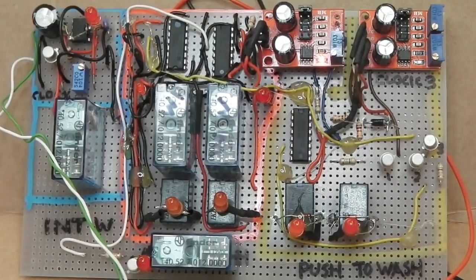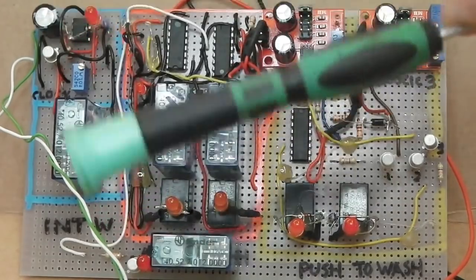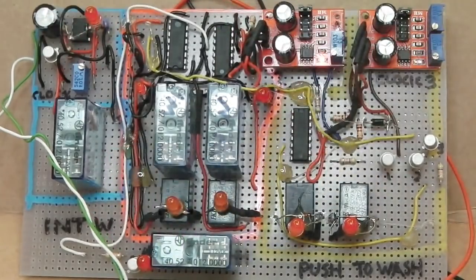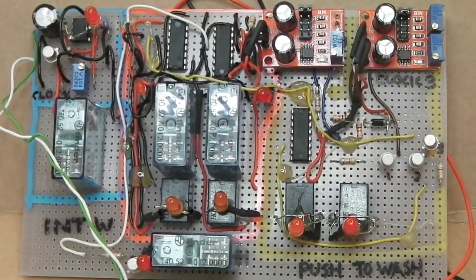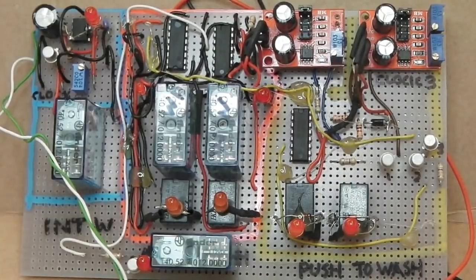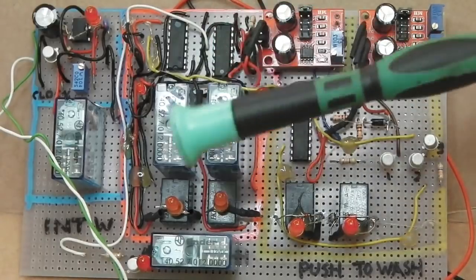I don't have the auto wipers, the rain sensing wipers, which we're going to be fitting, on all the time, although they are controlled by pulling the stalk down. At this point, if nothing's active, the automatic rain sensors are idle. So stalk down is your automatic position, but until I press the washer jet pedal, they don't become on board. The reason for that is sometimes if there's dirt and muck on your screen, they'll try and wipe dry. So I like to get it so that the module first squirts water up, then activates the system.